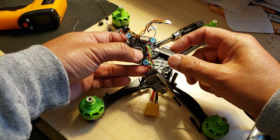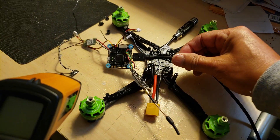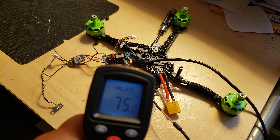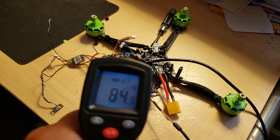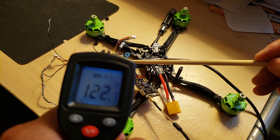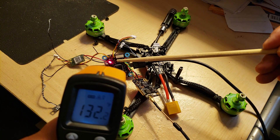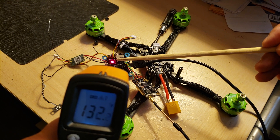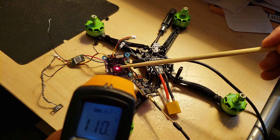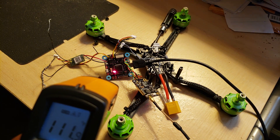Got power on and the temperature is going up again — already about 84°F. This little chip here is about 125 degrees Fahrenheit. This other chip right here is going up pretty high — 130, 139, 145, 140. This one here is about 124, then 130, 136 — it's going up pretty fast.